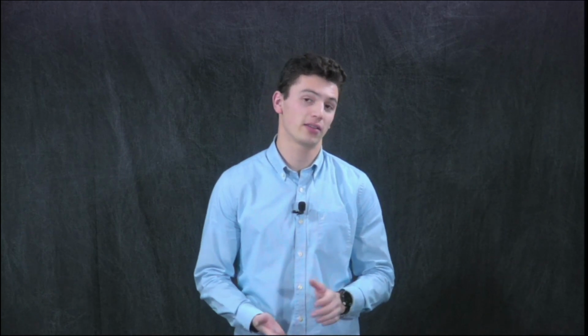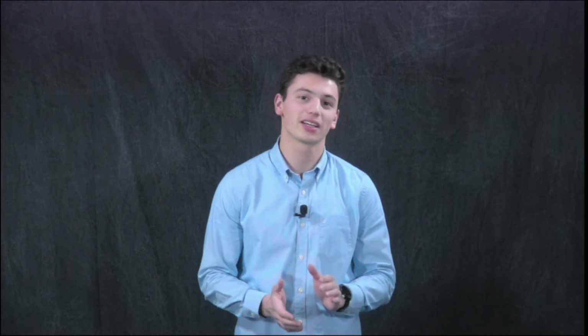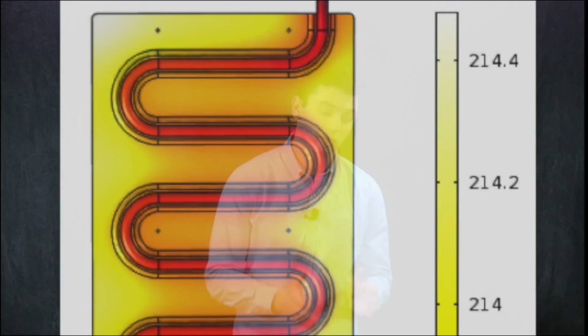In the realm of atmospheric research, experiments can be conducted in fairly extreme environments. It can be difficult to predict the exact behavior of scientific instruments without prior laboratory testing. So, in my senior capstone project, I am designing and fabricating a thermal shroud, a thermally controlled chamber that mimics the conditions of the stratosphere. I designed a simulation that couples heat transfer and fluid flow to confirm the effectiveness of my design.